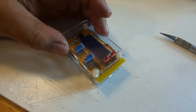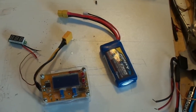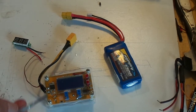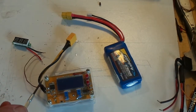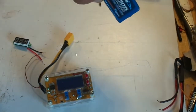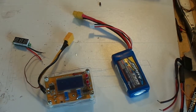That's where we ran out of video the other night, but it's actually a good place to break because Richie was installing and tightening the last four pan-head screws on the top plastic — and that completes the assembly. Now I've got it sitting on the bench with a power lead and XT60 connector that I can hook up to the battery — a two-cell LiPo, 1300 milliamp, 7.4 volt. We're going to do the calibration.